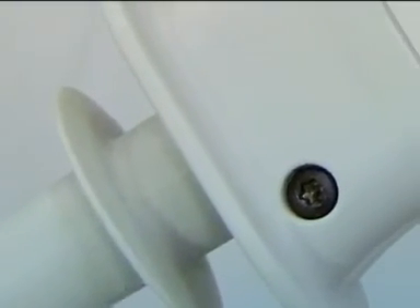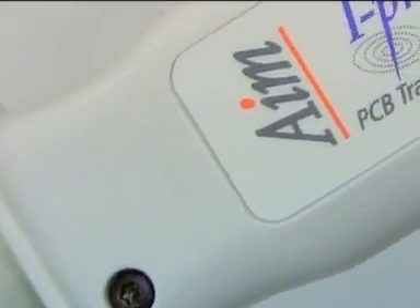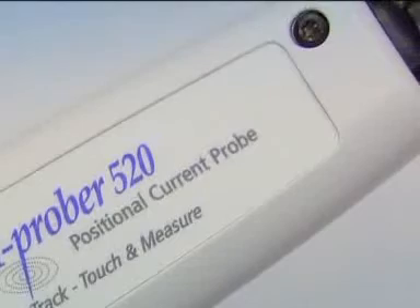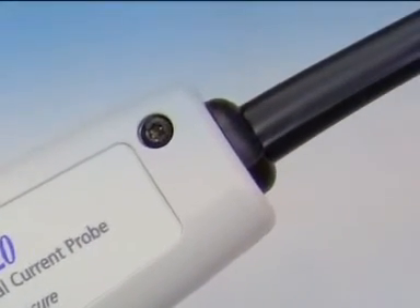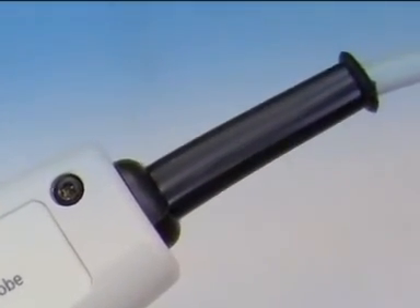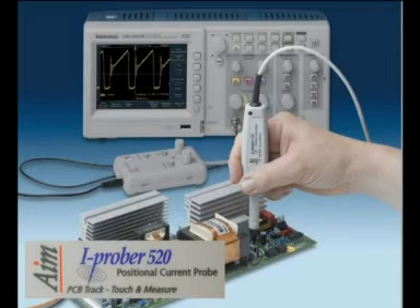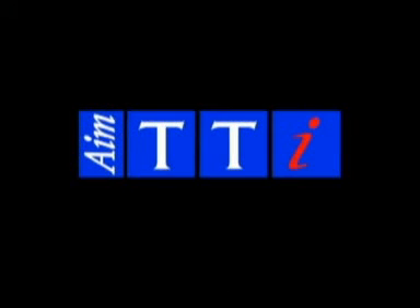The probe is light and compact and fits comfortably into the hand. The tip is made from high-temperature material and the probe is double insulated for safety on high-voltage tracks. The grip guard keeps your hand away from any high-voltage areas on your target PCB, and the whole probe is 300 volt CAT2 rated. This concludes the first part of my introduction to the AIM iProber 520. In a second part, I am going to show you more about the iProber in action and discuss some of the difficulties and limitations that you might come across and the various ways that you can counter them.